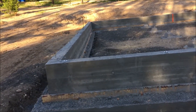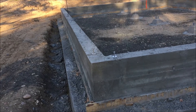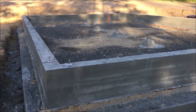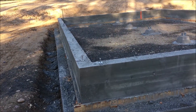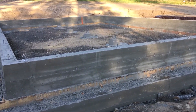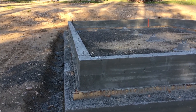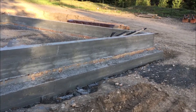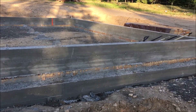The only issue we had was some of the footers down through here kind of blew out a little bit. We had a little blowout around where we built the subfloor with the footers — it's a continuous pour, so I knew I was going to lose some of those 2x6s. We poured the footers first and then the stem wall. When you pour your subfloor and stem wall with your footers at the same time, you don't have two separate pours held together only by rebar — you get a very strong, solid foundation.